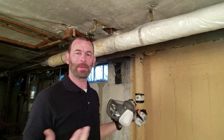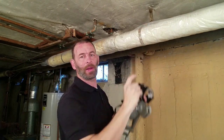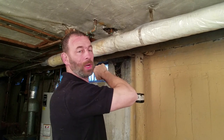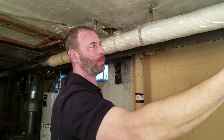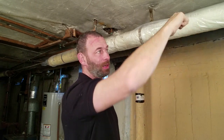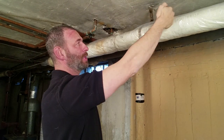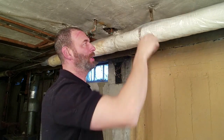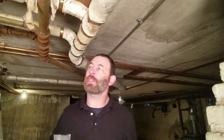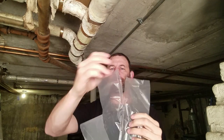So you can see there — I got that run done, about 18 to 20 feet. What you do is cut the plastic so it's going to wrap around and overlap a good 3 to 4 inches. Start on one end, lock that down, take it to the other end, wrap it over, and run your tape down the seam. Pull everything nice and tight every 3 to 4 feet, tape the seam together, then make your run. Anytime you have a penetration, make the fold right there, tape both sides, and you may need to do a plastic patch to cut around and cover it. I'll also show you how to do junctions in the pipe — make a little saddle cut so a flap goes up on the other side.